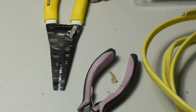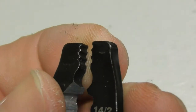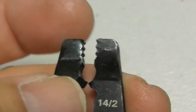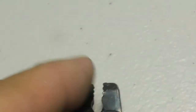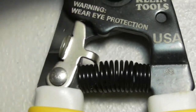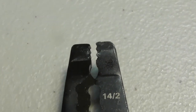I'm going to zoom in so we can look at this tool. At the very tip we have a pliers section — you can see the teeth on the end, that's a pliers for grabbing. That little round section just above my nail is for crimping a lug. If you know what a lug is, that will make sense — it's a little round barrel. You put the lug in there, squeeze it down into that upper hole, and it makes a crimp. Maybe not the greatest crimp, but it works.